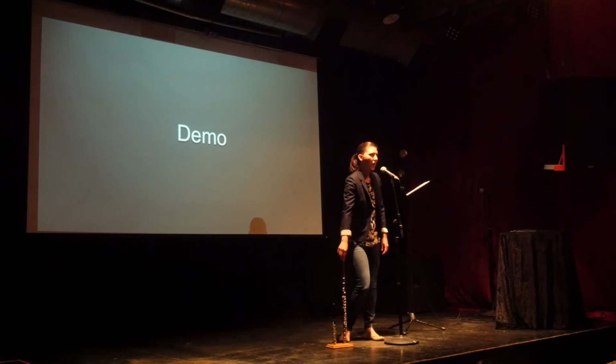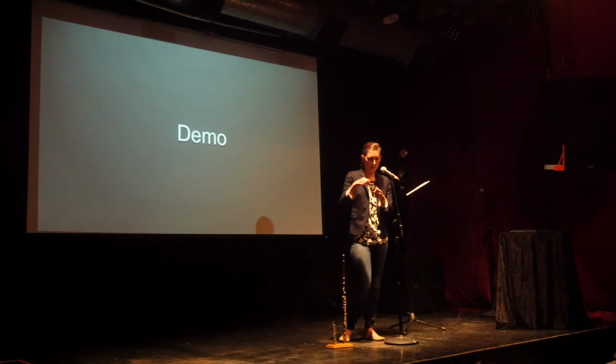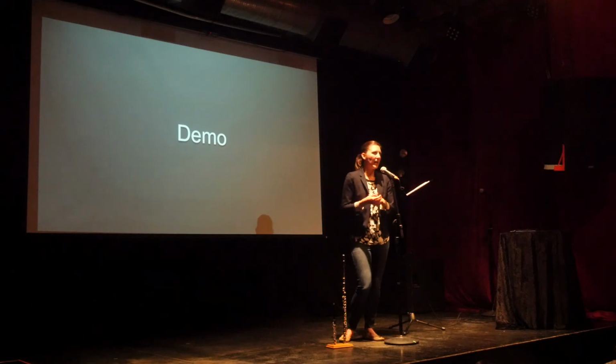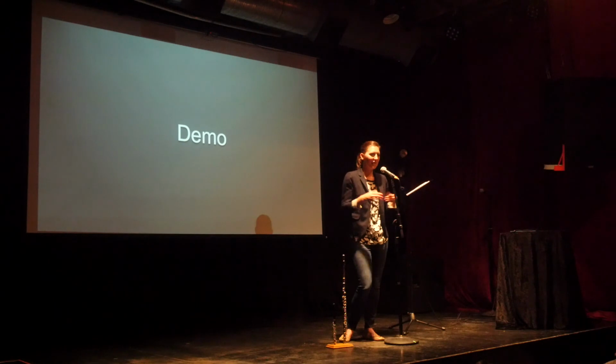This part is soldered, meaning that you take an open flame and a soldering, it's a silver solder or a gold solder, whichever one you're working with at the time, and you solder this lip plate to the body of the flute. But if you get it too hot, it's called scaling, will get on the instrument. Or in the worst case, I did this once, I actually melted the lip plate. So that was definitely one that you toss in the recycle bin.